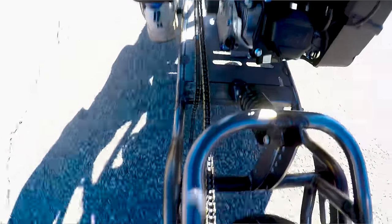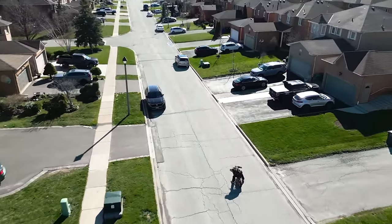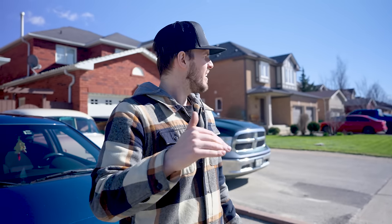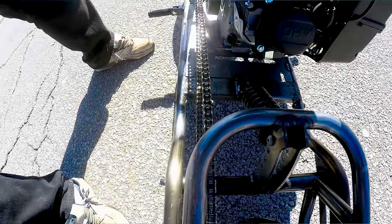There it is again! As my dad was driving by we heard a click click click. The chain might just be too loose because we don't have the jack shaft or a chain tensioner. There's a good chance that when it's loose it just hits the frame at high speed and breaks.